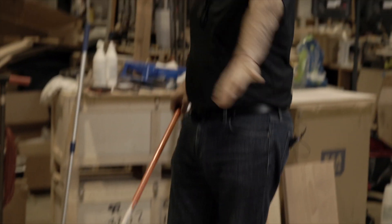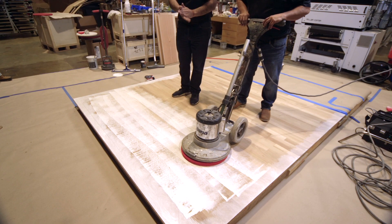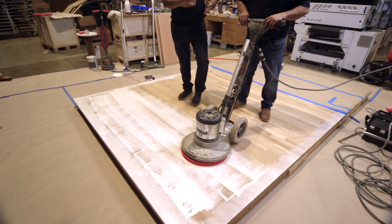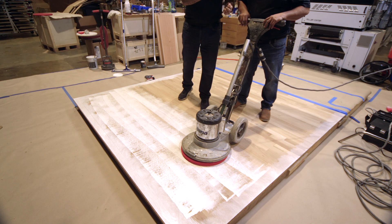I'm going to buff this in. You could do this by yourself or with another person's help. Because this oil will never dry on its own — the open time is forever. Unlike oxidative oil, this oil has a photo-initiator. Once you hit it with the light, then it will dry. So you will have all the time you need to cut all the corners and apply the oil.